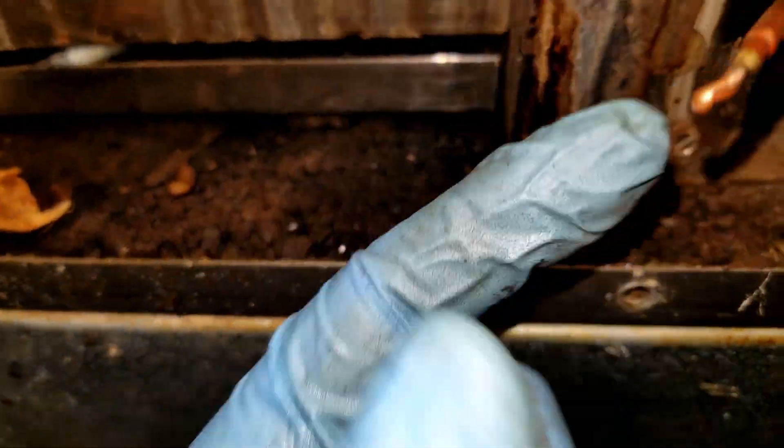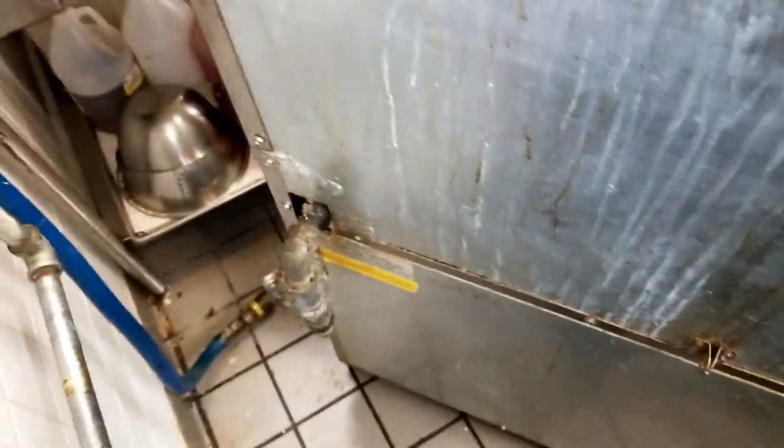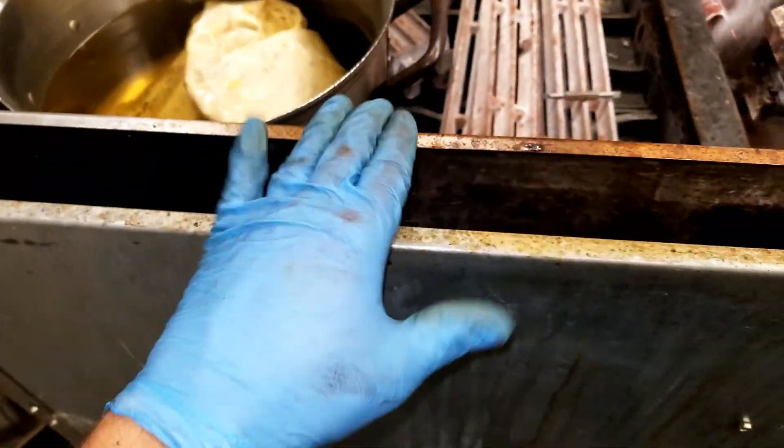On these thermostats, this little end piece here — they have it bent. For it to fit through these holes, you may have to straighten it out a little bit. Just be extra careful so you don't break it. Imperial has top-notch equipment, so just one more adjustment and it's going to have the same issue going down to this hole here — just be very careful. This whole panel here slides out and slides back down in place; it's a little bit of a fight, but that's just how it goes. The thermostat is now in place. Now it's time to put the fittings on and get the thermostat all hooked back up — slash safety gas valve or whatever you want to call it.